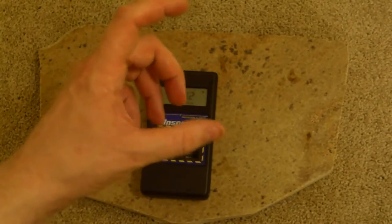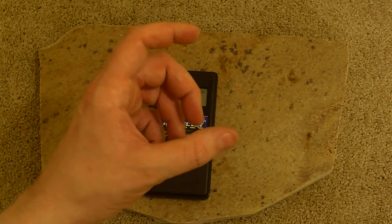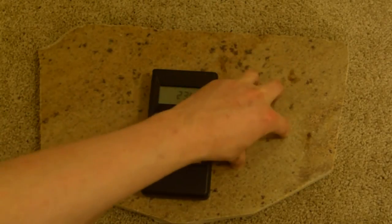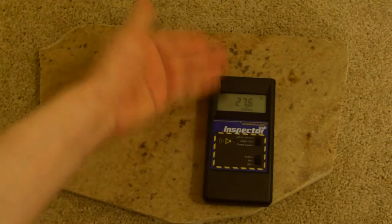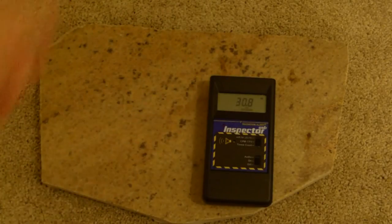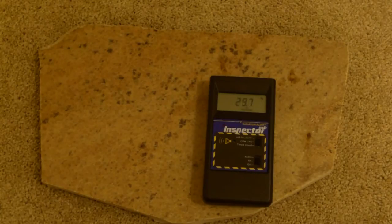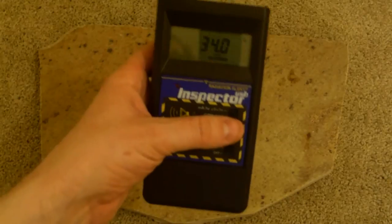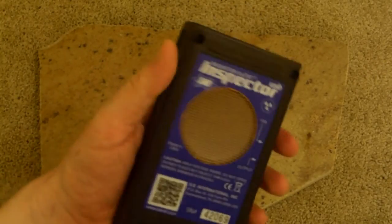see. So you go and you take an air filter or something, and you draw, let's say, 10 cubic meters of air through it, put it down, put this on top of it, boom, you have 30 becquerels. You could divide that by 10 and know that you have about 3 becquerels per cubic meter of air. So you could do simple math like that.